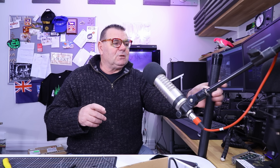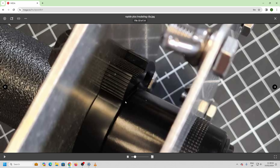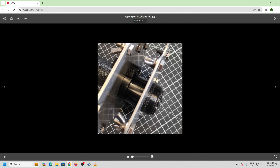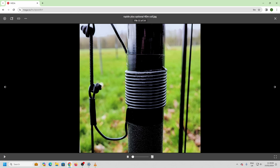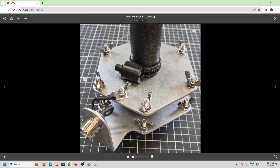I buy gray plates — they're three-eighths of an inch, about 9-point-something millimeters — that's pretty heavy plate, but completely UV stable. That's the cap after I got it out. I'm in two minds whether to just take this cap off, leave it off, put it in a drawer, and leave the ground plate permanently on the ground. There's a little herbie clip there to insulate it — it's called a herbie clip because it was apparently invented by a man named Herbie. For 40 meters, about two feet up — 60 centimeters, halfway up the pole basically — I wound 13 wraps.